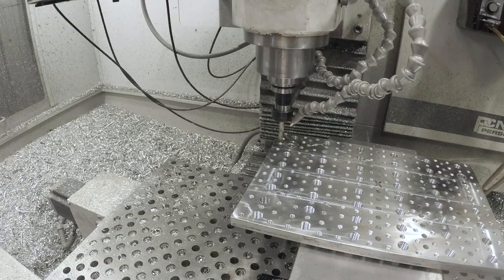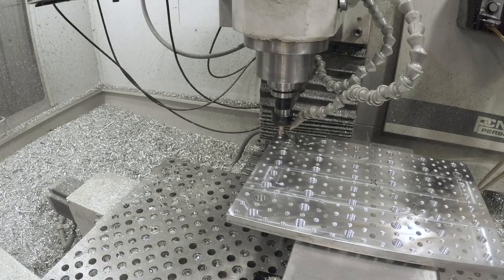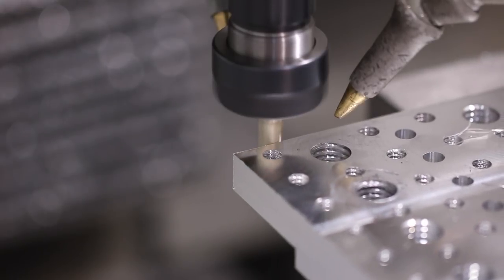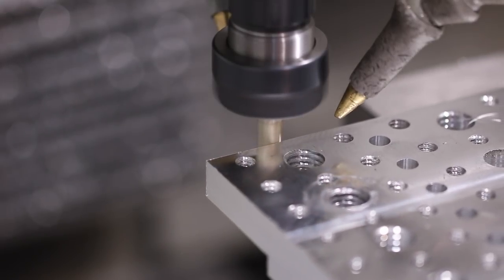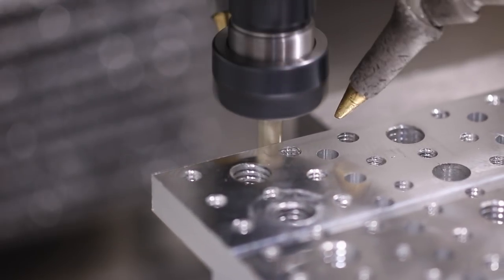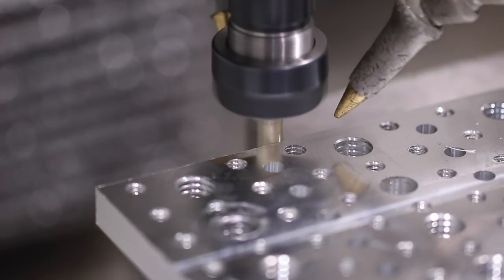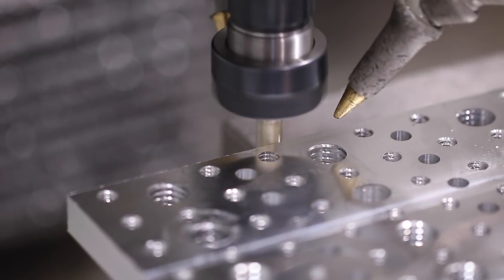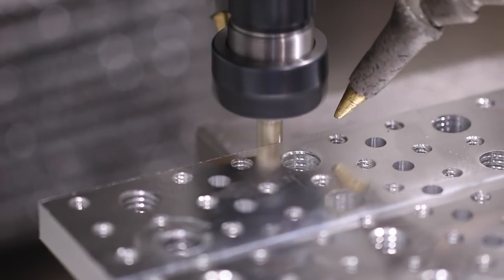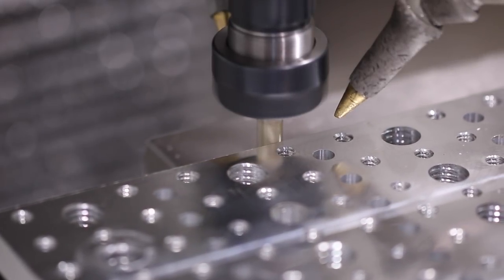And last but not least, clean up the Y. We'll see, okay, good. I didn't think we'd be trimming off too much here because the extrusion from Alro was only, I think, what would we measure that? 40 thou over, so I guess in theory it should be a 20 thou cut. But 20 thou is plenty. We'll be cleaning it up, which, the real test will be if the front side cleans up. I think we'll be good.